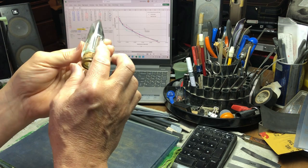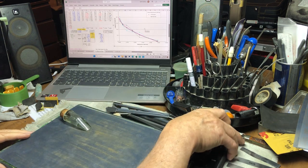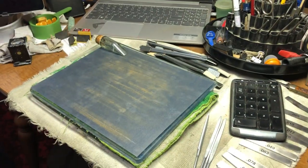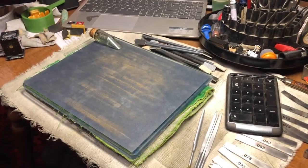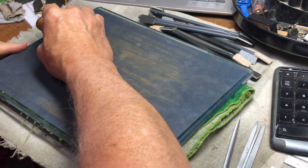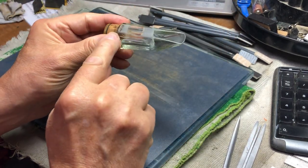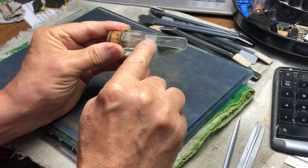All right, here's the Blayman. So we're going to start, since I know there's a high heel, I sometimes start backwards. Let me move this to make sure we're looking at my sheet, and I'll zoom in a little. I'm going to start actually backwards so I can put my finger on the heel and apply a little pressure there, because that's very interesting. You notice right away, I said it was a high spot at the heel, but actually it was here. It's cleaning up here and here.